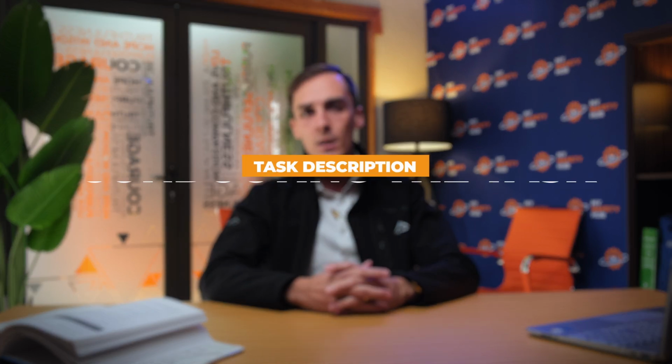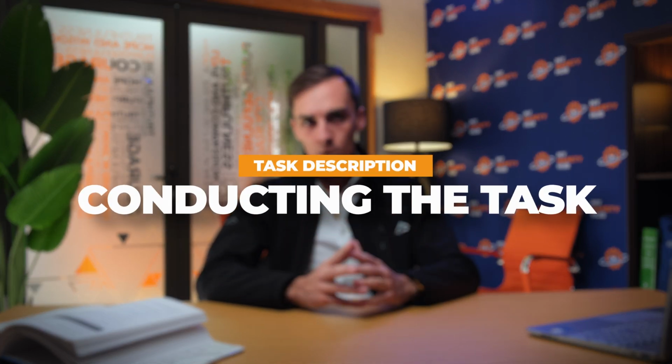Inspect slings and lifting gear for visible damage or wear. Ensure the workload limits are clearly marked and check wire rope slings for broken wires. Before operation begins, confirm the work area is free of obstacles and unauthorized personnel, and ensure everyone is wearing the correct PPE. Next is conducting the task.